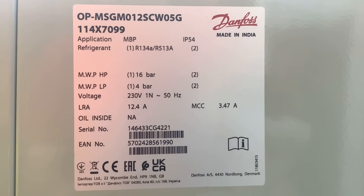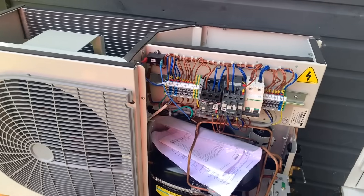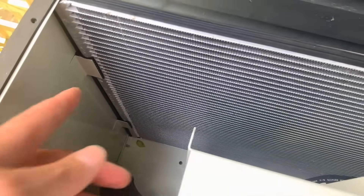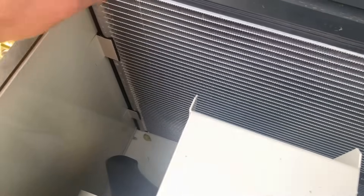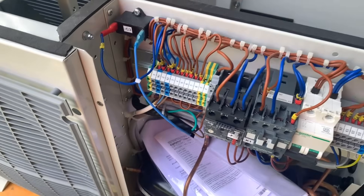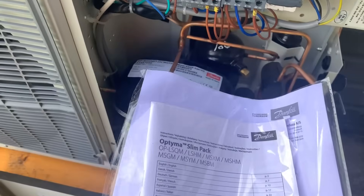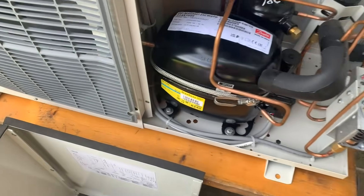Now we've unboxed the unit — we took the top cover and side panel off with just a few screws. Walking around, we have the condenser fan inside the plenum chamber with the microchannel. You'll notice the microchannel itself is not actually secured — it's fitted with a rubber gasket and locators, as the microchannel will expand and contract slightly with temperature. Coming down the front we have our grill, electrical components, and the compressor at the bottom. Importantly, instruction information supplied with the unit is available in various languages — please read it.